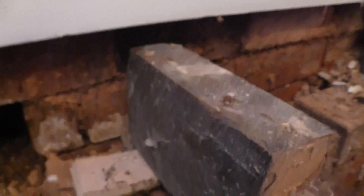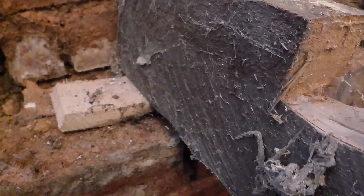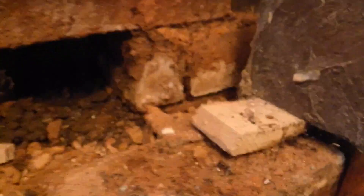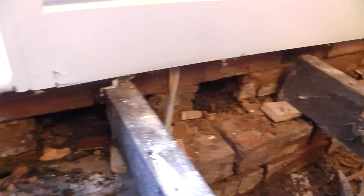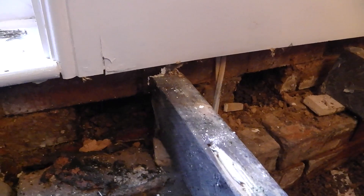Some two or three years ago I was told this whole section of wall collapsed, and whoever came along just put these little riser packers in under each of the floorboards to raise it up. You can see that even along here, several courses of brick, the damp has actually gone up and penetrated those risers. So again, no attempt was made to actually cure the problem itself.